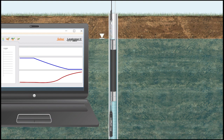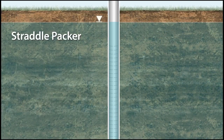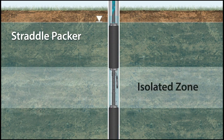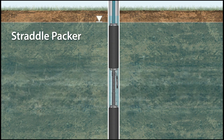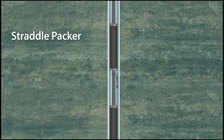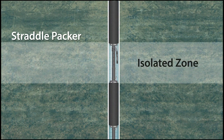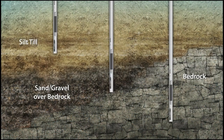The data is used to determine permeability at that discrete depth. In general, permeability or hydraulic conductivity tests like this can be performed using single or straddle packer setups. A series of tests can be completed at a number of different zones in the same borehole, helping to provide a hydraulic conductivity profile. Performing these simple tests in multiple monitoring wells across the site can help interpret the stratigraphic profile and provide additional information toward understanding the conceptual site model. Packers can also be used temporarily in other formations to prevent multi-aquifer flow during these types of tests, so neighboring aquifers are not affected.